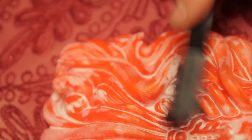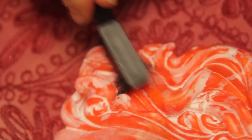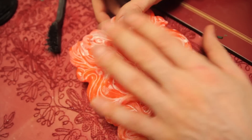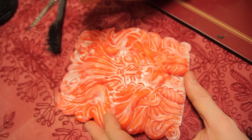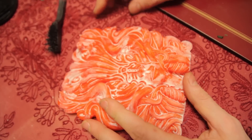Then get your brush. Once you've gotten rid of the residue, just brush over it to smooth it out, and then keep going. You're probably going to be about 10 to 15 minutes doing this, but the beauty is after you've done it all, it's done. You can spray it, or conductive coat spray it and then plate it, or do what you want with it — because all you're doing is correcting the tiny little things. The rest of it's smooth anyway because you've done the acetone.